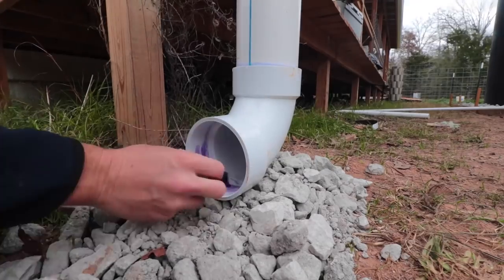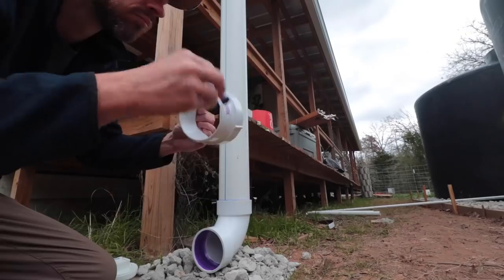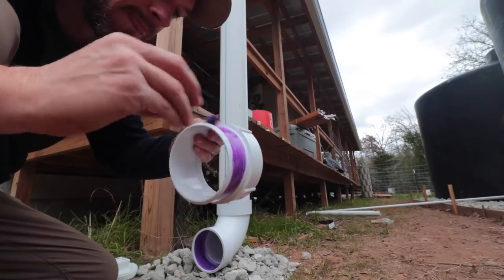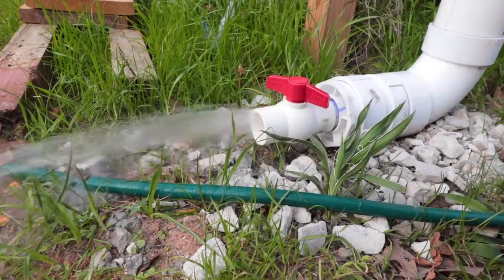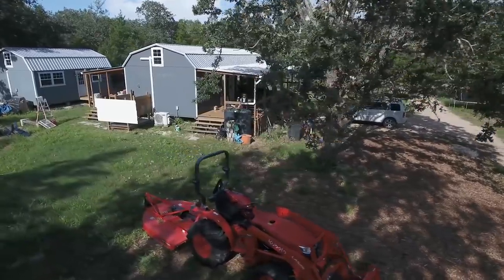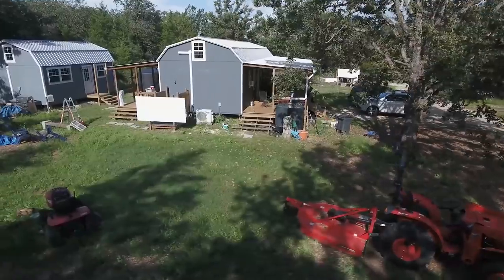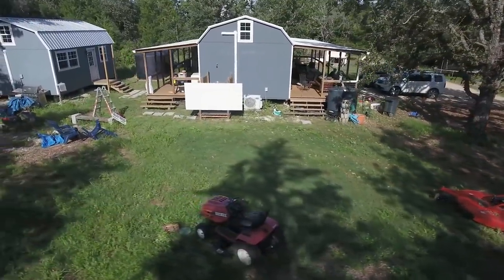With a system this big, we needed a first flush. This downward pipe collects all of the debris and bird poop and junk from your roof before it gets into the tanks. After a big rain event, you just open the valve and drain it out. We designed it this way so that running the water into our house from these tanks in the future is an option. We would add a filtration system before we do. If you like the idea of off-grid living, that would be your final step in readying your rainwater for drinking, cooking, and bathing.